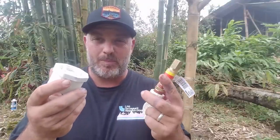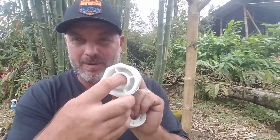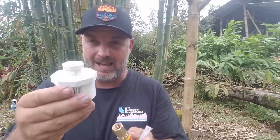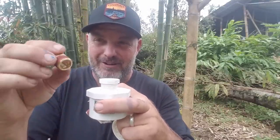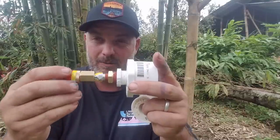Before we attach the final piece we need to screw it all in and tighten it down. This is a two-inch to three-quarter-inch female fitting and we're going to insert a three-quarter-inch male to half-inch female PVC fitting inside it. Then we have this little contraption made up of three parts: a half-inch to three-eighths-inch reducer, and then a three-eighths to air hose fitting. This last piece fits on your air hose. Let me show you how we're going to tighten this all together.